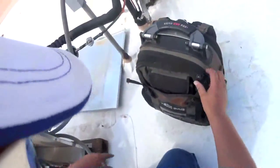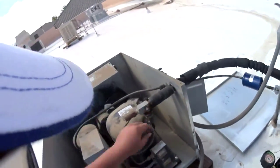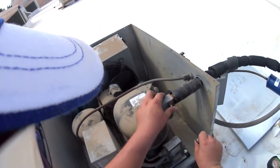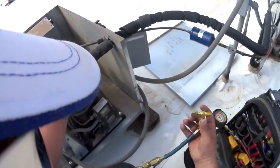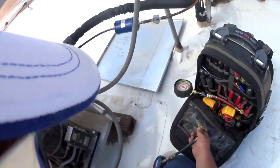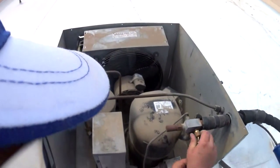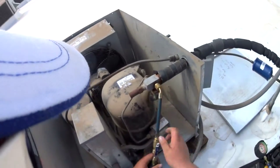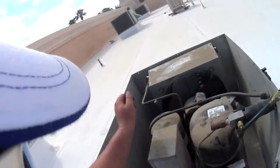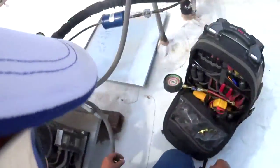I'm thinking something's going on with the pressure controls, if you said the pressure was all right. I mean, the guy that came out is a respectable fella, so I'm not doubting him. Still gotta do this king valve. They decided not to go with the king valve after we did the evaporator, because they thought that would solve their whole problem, and we kept trying to tell them, nope. Still definitely want to change that, but they didn't want to do it.